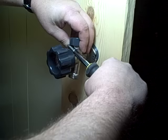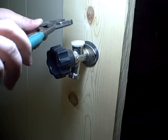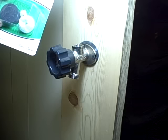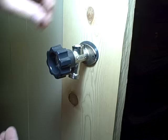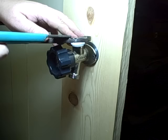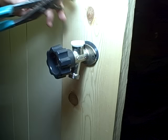To replace it, simply get a screwdriver up underneath and pry up on the top — it snaps off. Take a pair of pliers and unscrew the piece inside. Inside is the little plastic piece with the rubber on it that makes the seal, and all of those pieces are in the kit. Put it back in, rubber up, try to center it in the middle, and then this piece goes right over it. Tighten it down — it's plastic, so don't get too happy with it. Just snug it up a little bit with the pliers, and then the cap snaps back on.